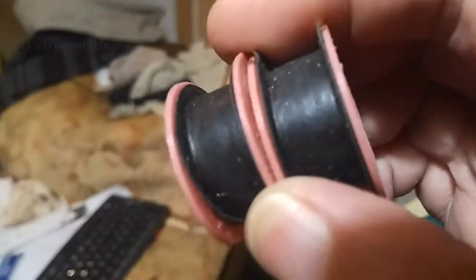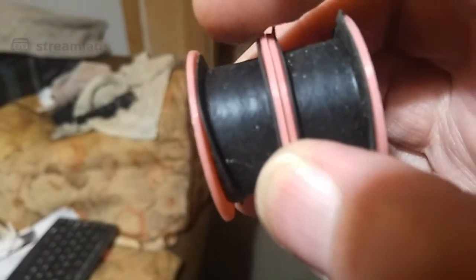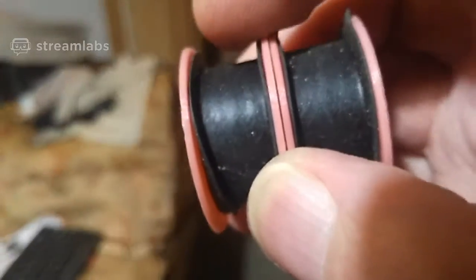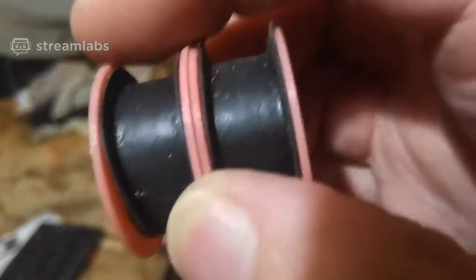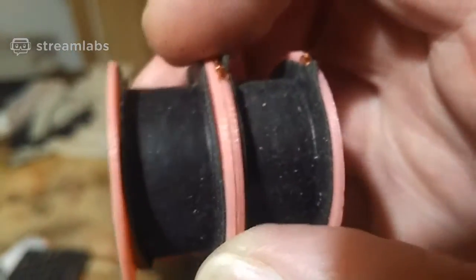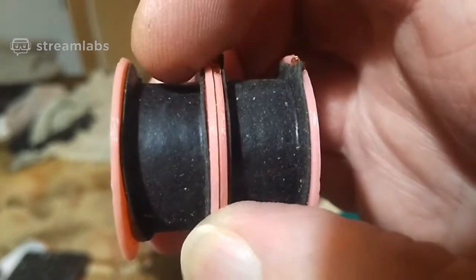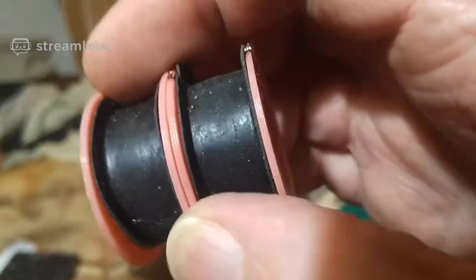I didn't do these the same though, but these bobbins I put rubber on, and you can see the rubber, and I found a better way of doing it. When I wrap the rubber around, I wrap it around the rim as well, because that way it stretches the rubber sideways, so that when I start to wind, the coil pushes the rubber down, because it looks a bit bowed before I start winding the coil, but I've got to tuck the wire right close to the lip of the rim. This self-amalgamating rubber stuff, as you wind the coil, it tends to buckle up the rubber, you see. It starts to bulge out. But if I already stretch it, it doesn't do that. So that's why I wound it in a different way this time, and it's come out a lot better. So anyway, as I say, that's the third one. And there's the fourth one.